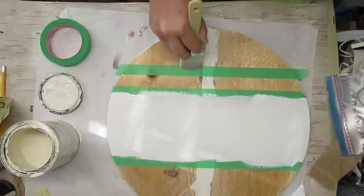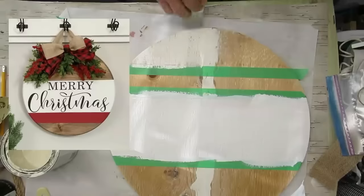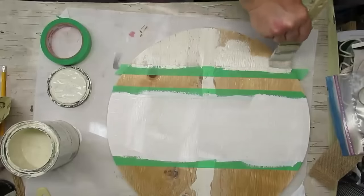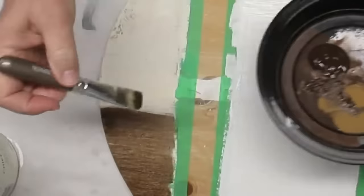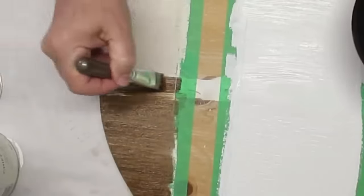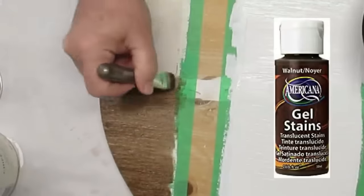The inspiration came from a customer — she wanted the bottom and top of the sign stained with a dark walnut stain. Because I put spackle on here and the two pieces are joined, I can't just give this a quick stain — I have to do a faux wood technique. Starting with a white base, once dry I'll go over it with another color. I'm using my chippy brush with a very light touch, applying Americana gel stain in dark walnut very lightly so I can see all of the brush strokes.